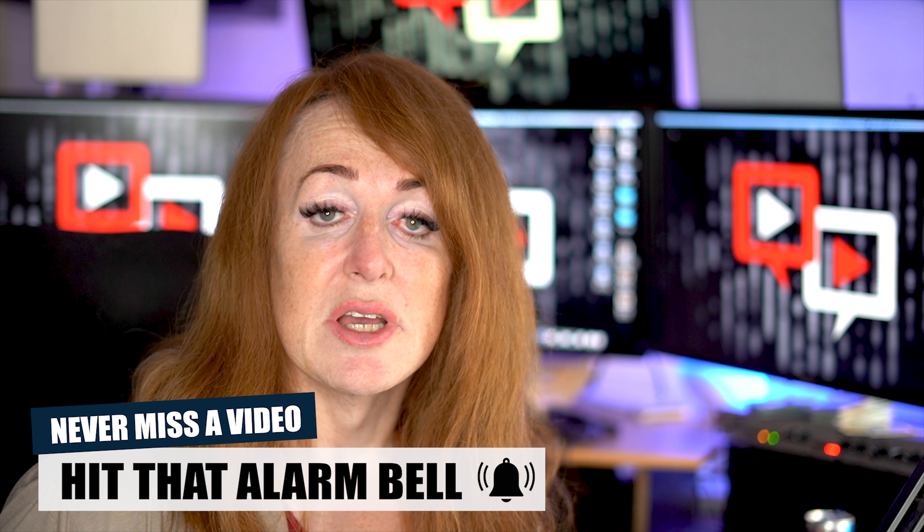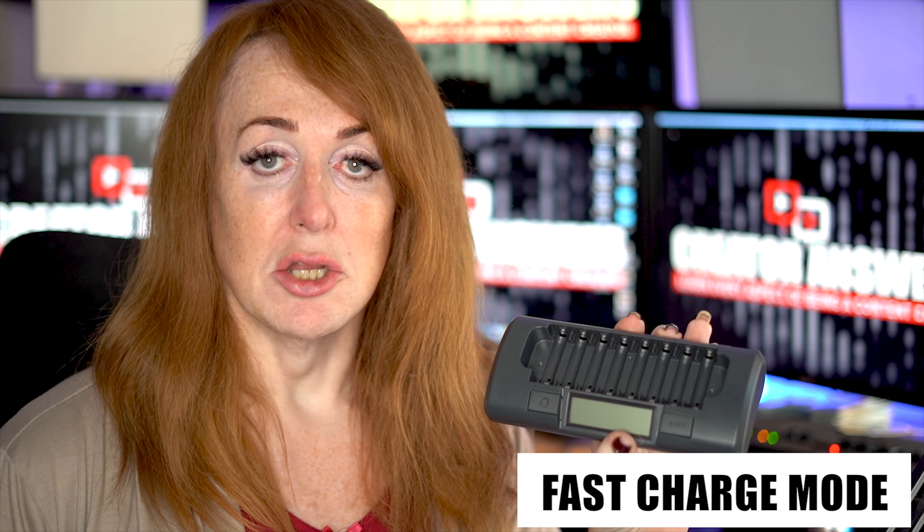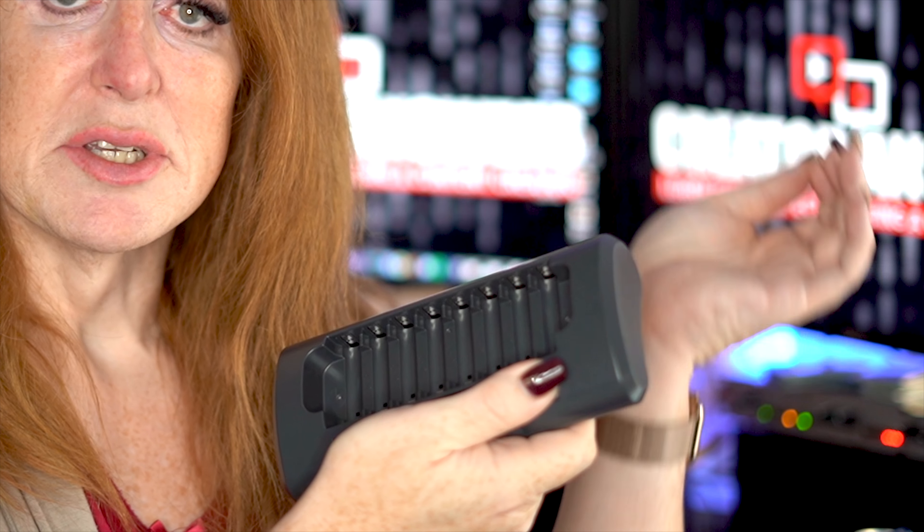I'll be covering the different types of rechargeable cells in another video. For now, don't buy NiZn. Now, to use — I've seen people complain it's a little bit difficult to use, but let me show you. If you just plug it into the wall, drop the batteries in, and it defaults into fast charge mode. Dead simple — that's what you're going to use most of the time. But if you want to use one of the recondition or soft charge modes, you literally unplug it, hold the button down, and then plug the cable back in again. I admit it would be nice if there was a little power switch to do that — it's a little disappointing, but it's that simple to use.